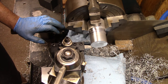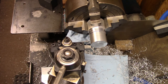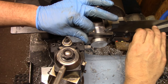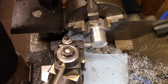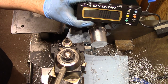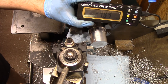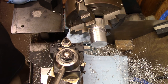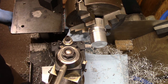Works fairly well, still getting some bird's nest - not quite got it dialed in where it's breaking the chip. I've got to get this diameter down to 28. We're at 40.4, so we need to take 12. Let's take five millimeters - that's 10 in total, a good healthy cut. Actually that's almost 200 thousandths, we're not going to take that. Let's redo that - a millimeter and a half. That's a healthy enough cut for this machine.